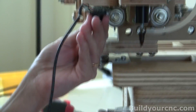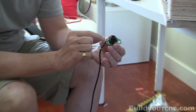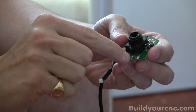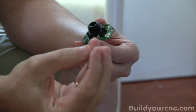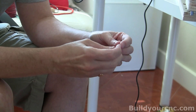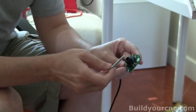The camera is going to be located in this position. We need to first do a couple of things. This hole is really close to a couple of capacitors, so we need to space the head of the number eight screw away from that. We're going to use the screw and put a spacer on it so it doesn't have any electrical contact with the capacitors at this point.